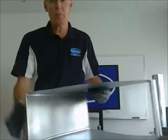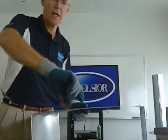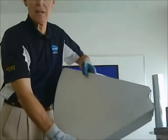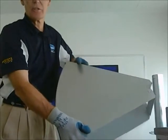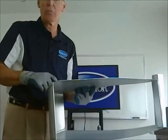This is a flatway elbow because the air travels in a horizontal direction, or the flat direction, like this. This happens to be a 45. I'll turn it on an angle like this, but the air travels in the horizontal direction. Always, this width is the longest part in a flatway.